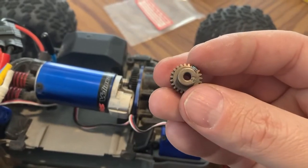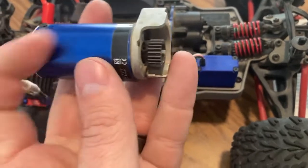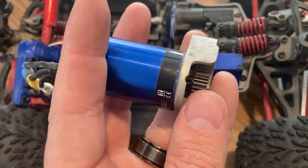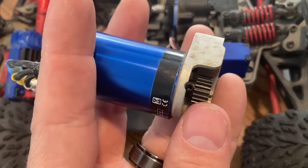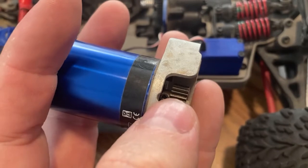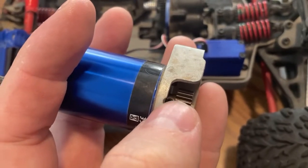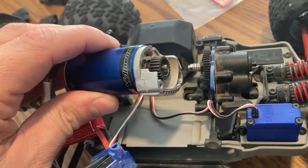Just slightly thread it on, and now we're going to slide that on. You do not want to slide that pinion all the way back. When you slip your wrench down into that screw, you want to use this little indention here as a guide for placement. At that point, just reinstall everything in reverse order.